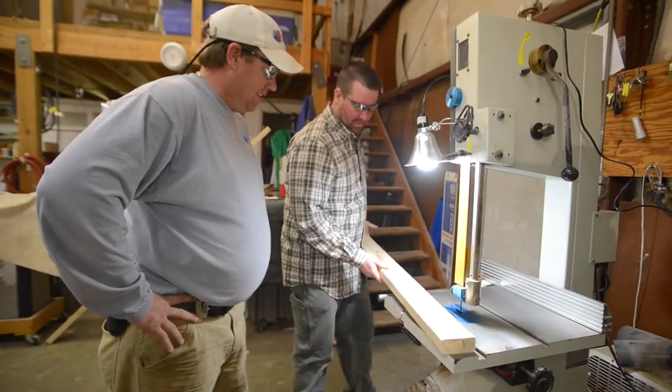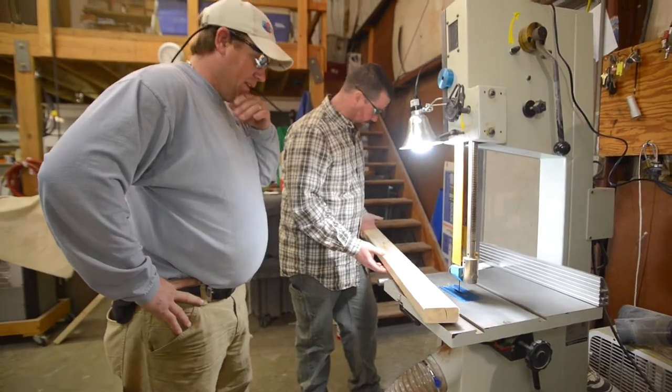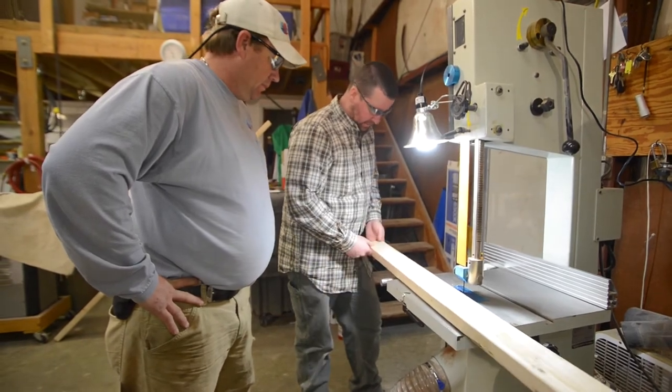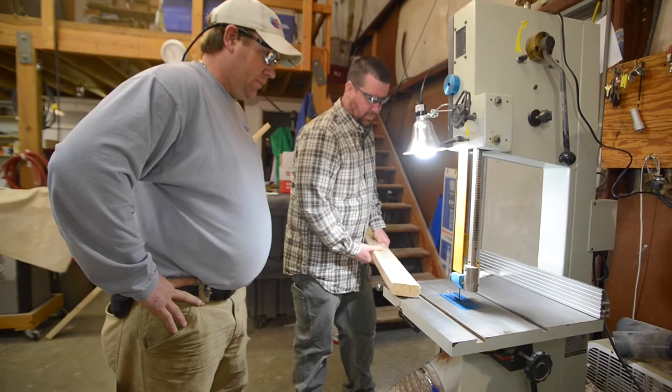In this case, really just jig pieces for making the top cut to length. We're now going to cut across the length of these on the lines we established with our batten for our curve. And we'll do this on the bandsaw.